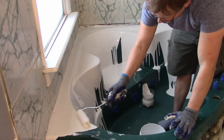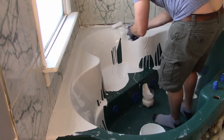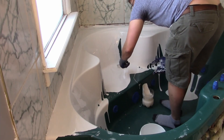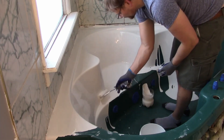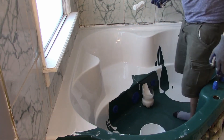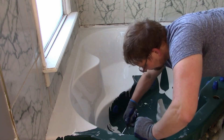I slide it across the top to guide the excess down the sides. Typically, since this product self-levels with gravity, you should pour two-thirds down the wall and pull the product up from the bottom to cover the last one-third. You don't really need to paint it on — it kind of goes where it wants — and you don't want to keep pulling it down because you might create a thin spot, so you want to pour it up at the bottom.